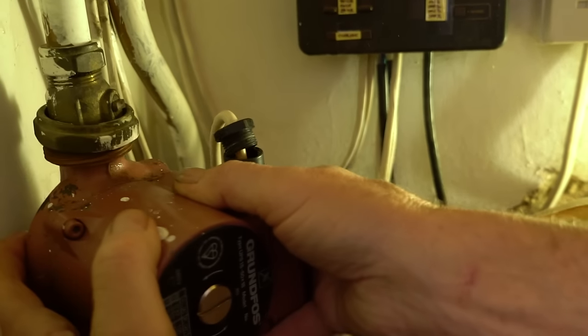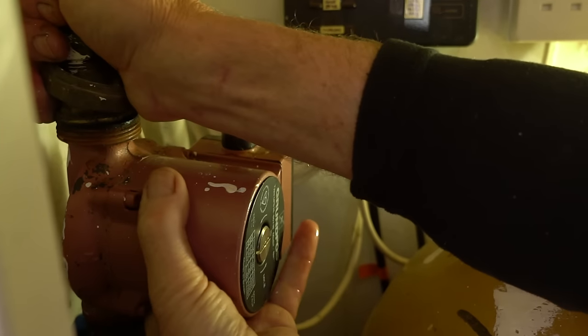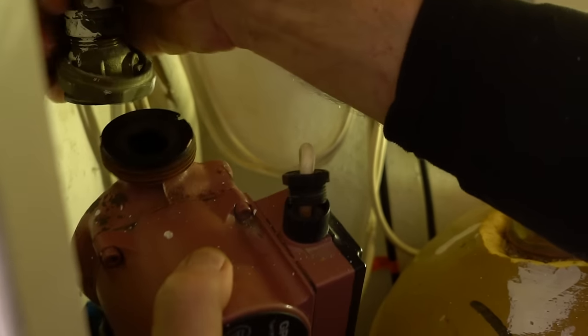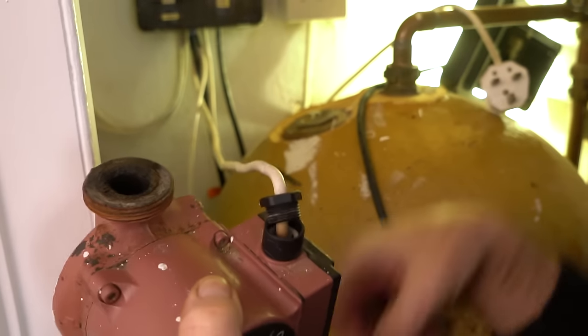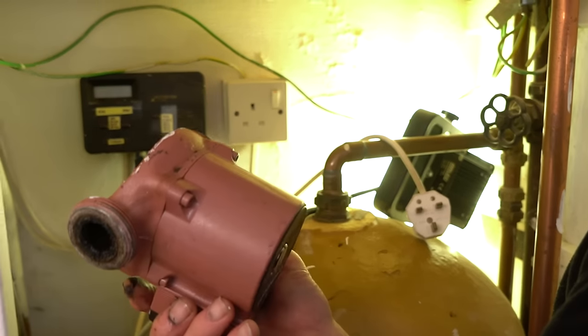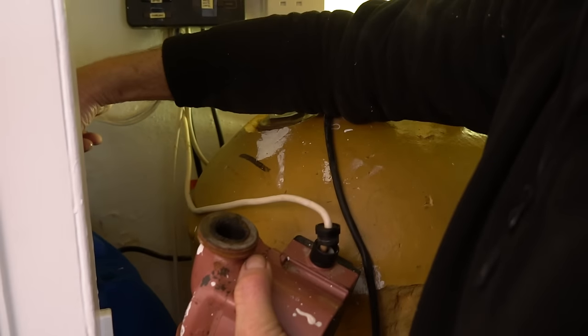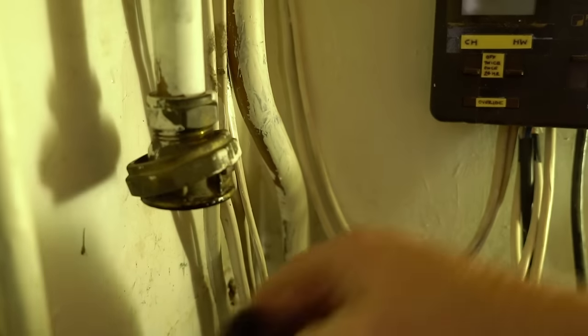So they slip up and this now comes out of position. You see what it is - a couple of unions there, a couple of rubber washers. Look at that rubber washer - that's completely decomposed. You can see the steam coming out of here now. There's another rubber washer on the bottom. Take that one off, make sure it's clean before we put the new ones back on. So we just rub off any residue - this is all decomposing rather badly. Give it a little wipe with some emery or whatever, just to make sure it's clean.